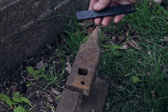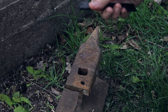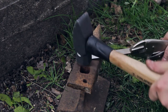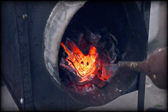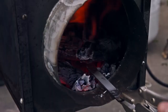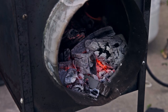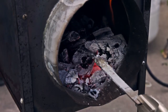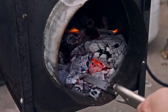I've decided that this first piece of steel is going to be way too thick and take way too much work to pound out. So I've got a little bit thinner piece of steel I'm going to try heating up right now. This piece is thinner — it's working a little better for me. Nice and hot. I haven't been able to draw it out like I wanted to, so what I think I'm going to have to do is kind of fold it over on itself for the handle, as I work my way out towards a usable spoon and then flatten out the flat end.